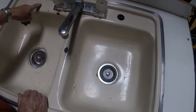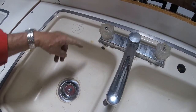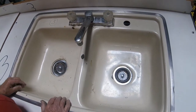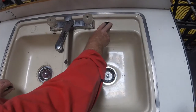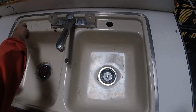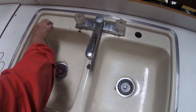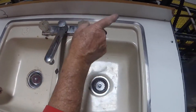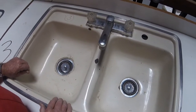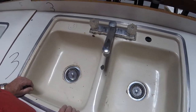The hole could be on the left if we ordered a four hole on the left, or we may decide to order a sink with five holes if we had a dishwasher with an air gap, and also wanted a hose and spray, and also wanted a lotion dispenser. There are special drills that can drill this without chipping the enamel and add as many holes as needed. Often times there will be a water treatment system, and from one of the holes will be a gooseneck spout for the treated water.